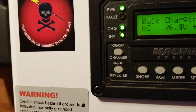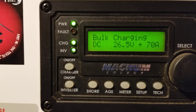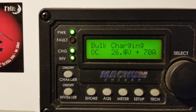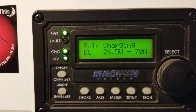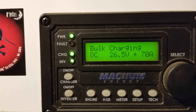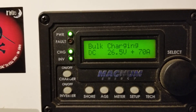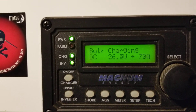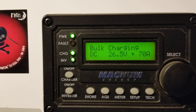The diesel generator is rated for 3,000 watts at 8,000 feet elevation in extreme weather. The diesel part will handle a 4,000 watt load and the generator head will handle a 4,000 watt load — typical of military stuff. They derate it so it's called a 3,000, but surging to 4,000 isn't an issue.